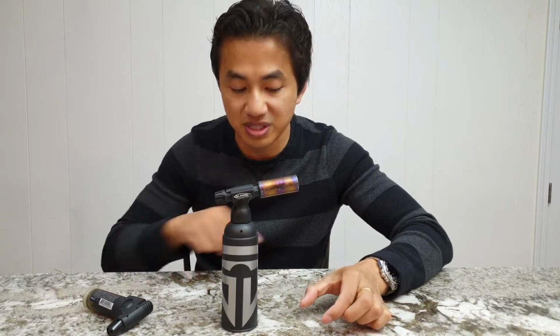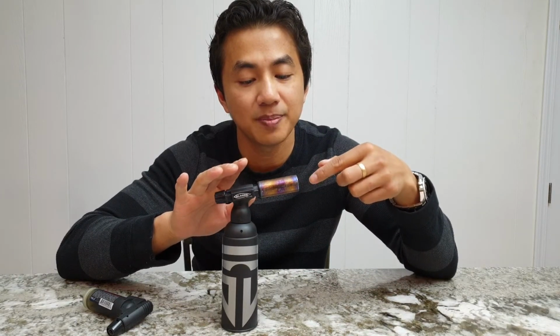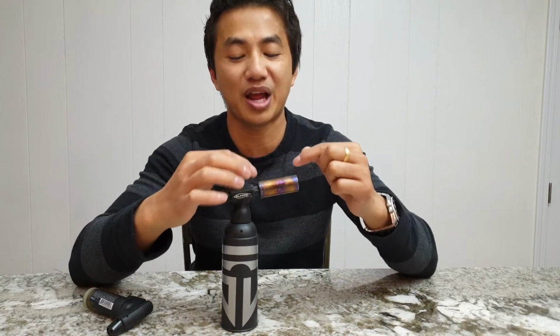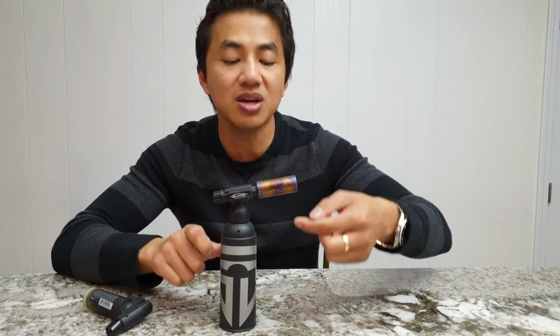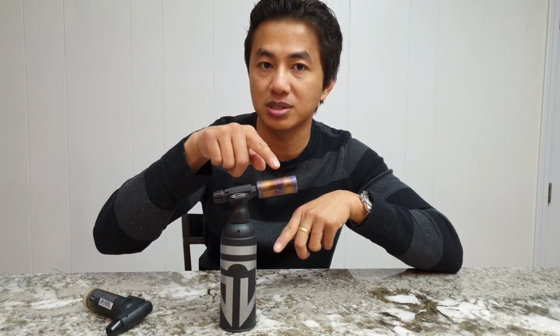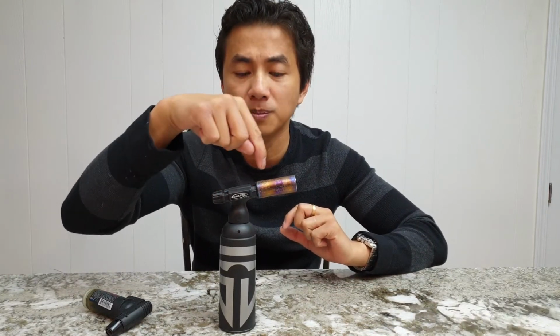I just want to hit it right around the edges. You could do this by hanging it up, or you can just stand it on a surface and then heat just the edges. Then you stop there, and then you do the other edges. And then you should get roughly the outer part to be the lighter bluish color, and by this time you will have a darker purple color here. If you don't, you can run it over a little bit more. If it doesn't draw enough heat to the center, it makes it turn purple because it was gold to start with. And by the time that happens, the midsection turns purple.